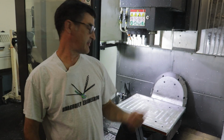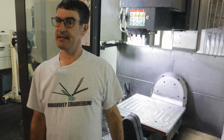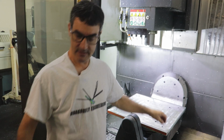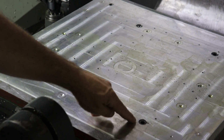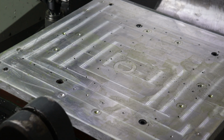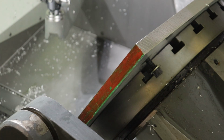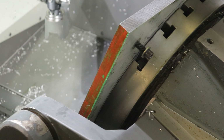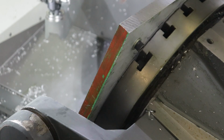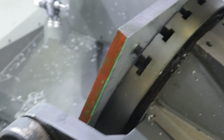All right, now I've just got some footage showing the milling of this plate. It's pretty basic. It's just a kind of manual drill press. I did get a special countersinking tool for these half 13 screws. These half 13 screws were basically manually drilled on the drill press, and those half 13s fit into the T-slots on the bottom in the round stage of this 5-axis milling plate. So there you go. And then these bolts were actually through drilled, and then these bolts actually bolt my mold onto the plate itself.